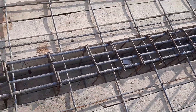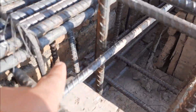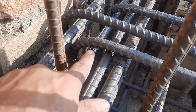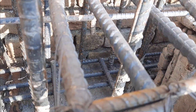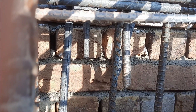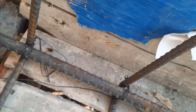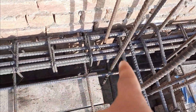The beam has a development length of a minimum of 12 inches. These are steel rods bent downward, and the downward-side steel rods transition to the upper side. They provided development length which makes a good bond between steel and concrete. This is very important to provide for floor beams, especially at the ends. I hope this short video helps you with basic information on steel structural design for floor beams and slabs. Thanks for watching — see you in the next video, goodbye.